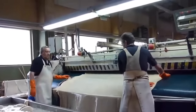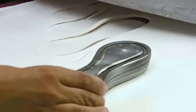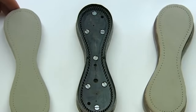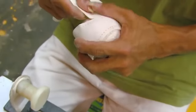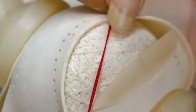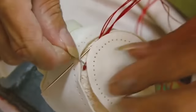Skilled craftsmen carefully inspect the leather, discarding any flawed pieces. The selected leather is then cut into small circular pieces using precision tools. After the leather is cut, the pieces are ready to be stitched together. The stitching of a baseball is an art form in itself. Skilled artisans use a special waxed thread and a specific stitching pattern to ensure the ball is tightly sealed and holds its shape. Major League Baseball requires 108 stitches to enclose the cover, while other leagues may have different stitch counts.